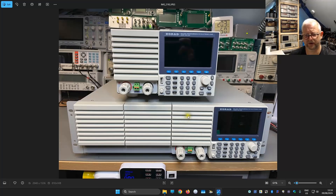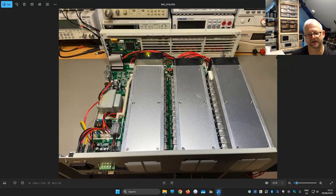Here you have the control unit, then the first main unit with the shunt. That's what limits the current for this model to 40 amps — both the 40-amp and the 1500-watt versions. The first 500-watt unit has the shunt, and then they added another 500-watt module. So the 1000-watt version looks the same, and the 1500-watt has three modules: 500, 1000, and 1500. But what they did on the older platform was add extra 500-watt modules without the shunt, which is why that series was limited to 40 amps.